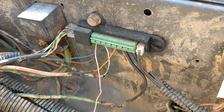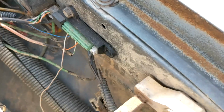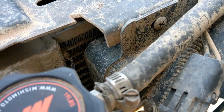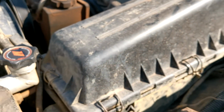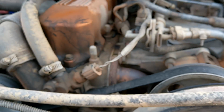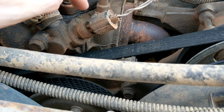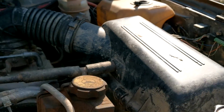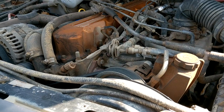So it'll look a little something like this when we have our temperature probe plugged in, and all of our different wires for all of our stuff for power and fans and all that stuff. So the included push-in probe can fit into the radiator fins like so. So you can press that in there and be good to go. Or we've got other options. So for instance, the 96 and up XJ thermostat temperature probe, I have a profile set for that. So I actually have this one running to the unit as well. So this is highly customizable to work however you need it to.